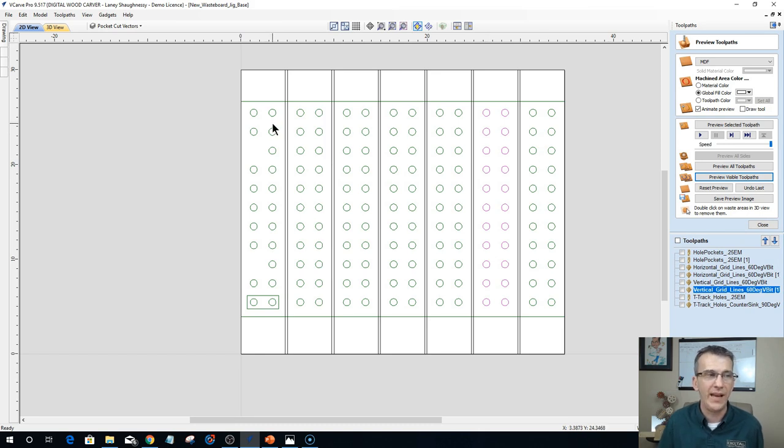And once I make the tool paths for those individual slats, all I have to do is run the tool path. I'll have a surfacing tool path for slat number 2, a surfacing tool path for slat number 3, 4, 5, 6, and 7, and 1. I'll have a hole pattern tool path for slats 1 through 7, and I'll have a grid line pattern for slats 1 through 7. So once I have those files in a nice folder, I can replace any one of those slats that I need to. I can surface them all down.